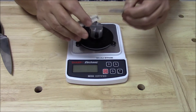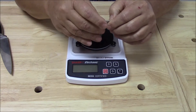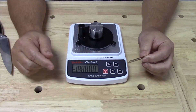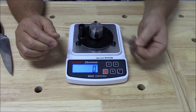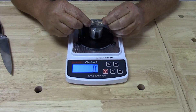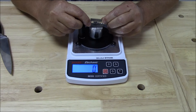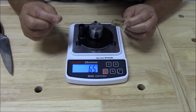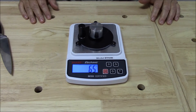You're probably tired of watching us measure razor blades and just get 50, so let's mix it up. Let me get the blade out and turn on the PT50B. I'm going to tip the blade back towards me about 5 degrees and go straight down. The reading came up as 65 — which I would say is about right for how much I tipped it back. Just a little demo there.